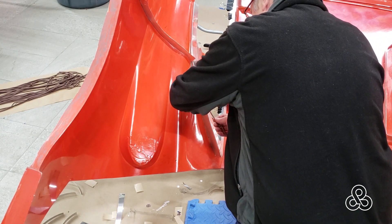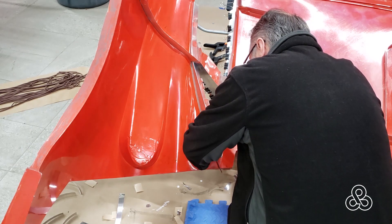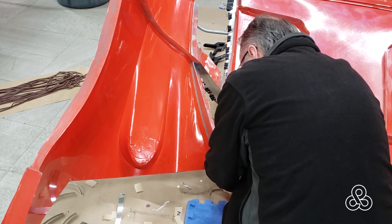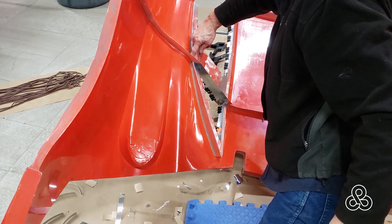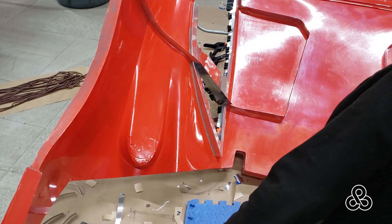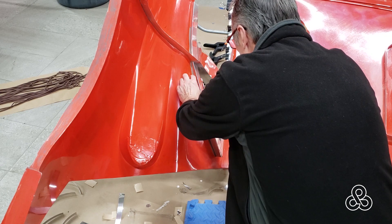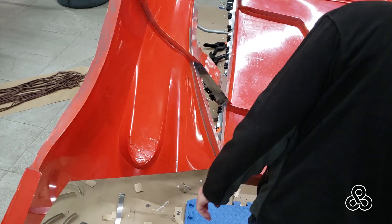What you do is just press this clay with your finger into the corners that you're trying to fillet. The radius on your finger is going to change with its flexibility, so once it's pressed into place, it's a matter of coming back with a tool. I have a little sculpting tool — just a flattened wire on a piece of wood — bent to a radius larger than the finished radius, to cut away the bulk of the clay to get close to what the radius is going to be. Taking that tool and running it right against the edge of the mold and the flashing cuts all the clay away except for a minor bit left for the radius.